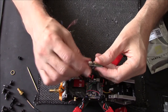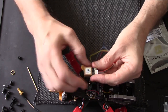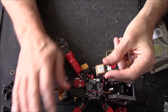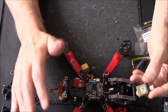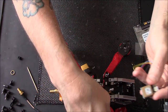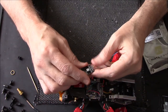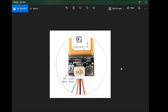These are straightforward. You've got your soldering pads on the back in case you lose the JST clip. Just in case you don't know about GPS: the ceramic part faces up on your quad. Ideally you want it as far away from any antennas and electronics as possible, but that's impossible on a little quad — it's always going to be near some sort of electricity. Minimize it the best you can. I'm going to put this on one of the front arms because I'll have my FPV antenna and receiver coming out the back.